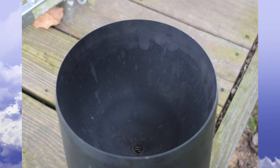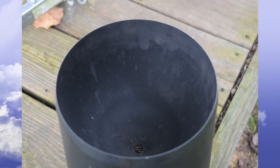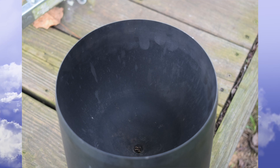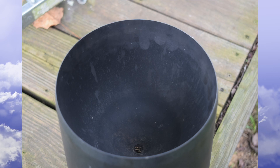This is the problem I mentioned before. In this design, there is no filter to prevent debris from clogging the funnel. A large percentage of the time, I find that it's birds that actually cause the issue — they'll land on the top of the funnel and leave their mark on the inside. It's kind of gross. But I believe the next upgrade in this design, while the cylinder retained its shape, Davis added bird spikes to the top of the funnel to prevent birds from landing there. The documentation I also mentioned the introduction of a debris screen that prevented anything, once inside the funnel, from clogging the hole.